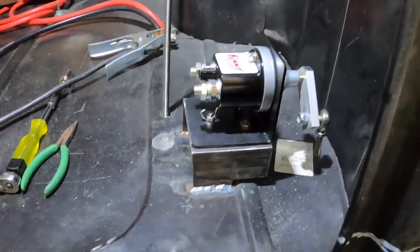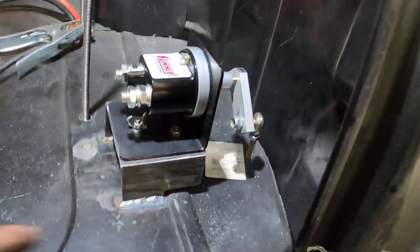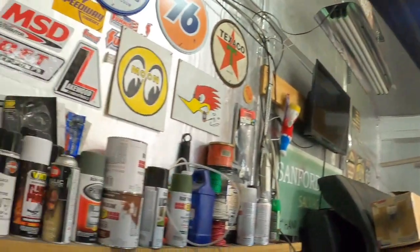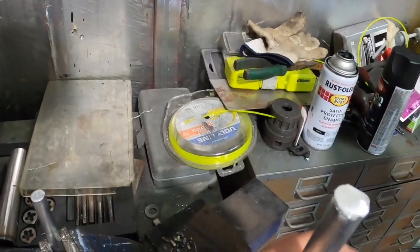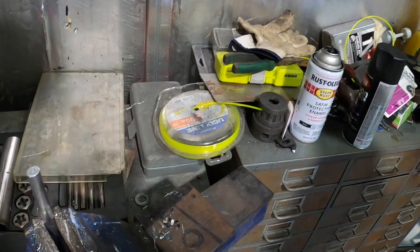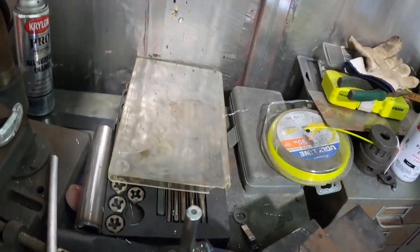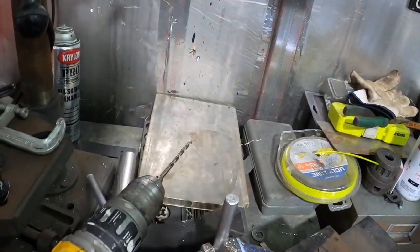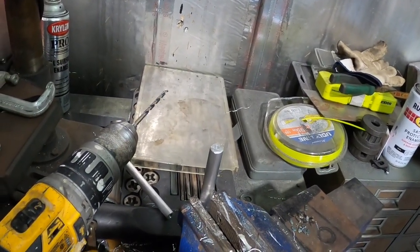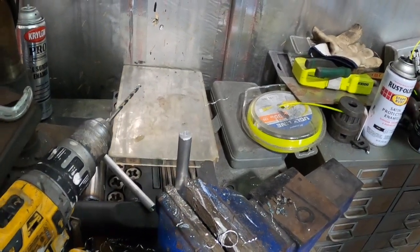I got a little ahead of myself — I tacked it, tested it, it worked. So I went ahead and welded it up inside and out the whole way around. The handle was too long so I started cutting it down, and that's when I stopped and realized maybe I should show you guys what I'm doing. I cut it to size, but unfortunately the thread doesn't go the whole way through. I wasn't going to build my car to match one piece, so I cut it off. Now I'm drilling this out — about halfway down — then I'll tap it out, put the handle on, and test it. I'll also sand this down and make it nice and polished.